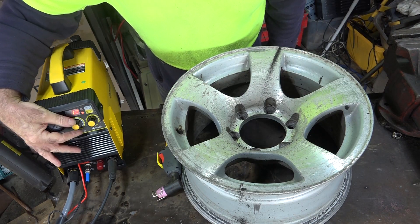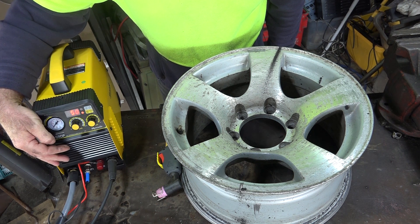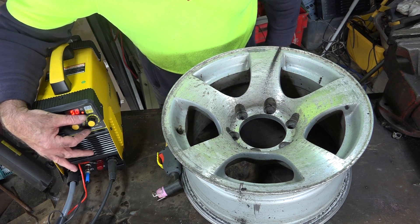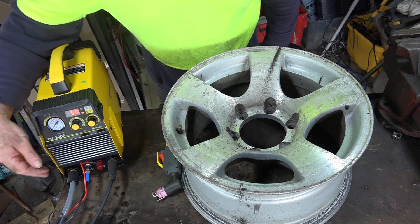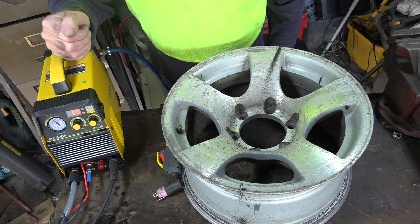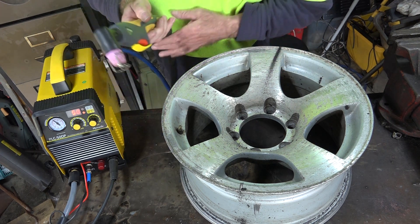What I'll do is turn it right up to 50 amps to start off with and see how we go. I think the heat penetration on the aluminum is a lot quicker than what it is on normal steel, but we'll have a look anyway. I'll turn the post time down here to about 0.2 to 0.3 of a second. And we're running at about 60 to 65 psi. I like to crank the psi up a little bit and then I can judge how the machine's going to cut. Anyway, let's have a go and see what happens.